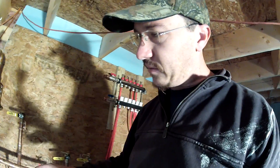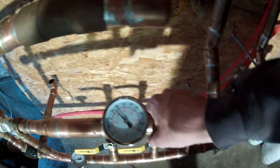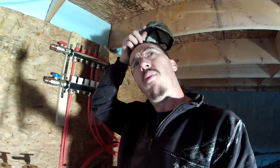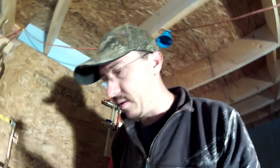It's up to 110, so this mixing valve should limit it at 120 - it will never go past there. It's actually reading 125. That's because with radiant floors, you don't want to put 180 degree water right next to your floor because all the boards will warp and it'll be a bad thing.